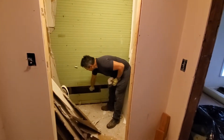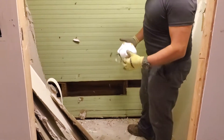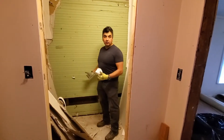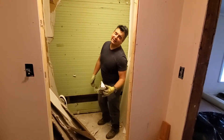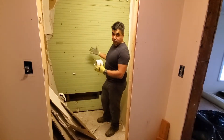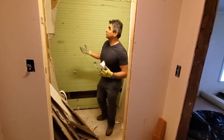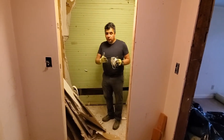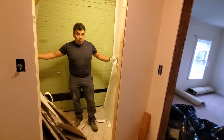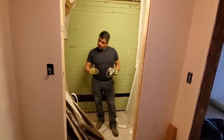Notice that this is the exterior wall and there is no insulation. We're going to have to add insulation, reinforce it, and make sure everything is nice and sturdy — it'll take a huge amount of energy to heat or cool this space without it. The partitions were made in a really rudimentary way. Since this is the master bedroom, we're going to make it bigger, especially expanding the walk-in closet area, so there's more room for furniture.